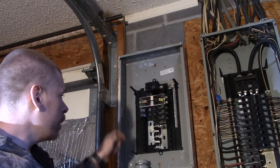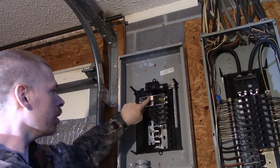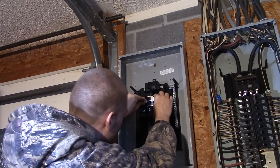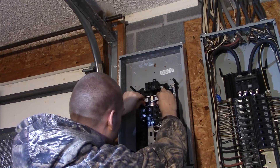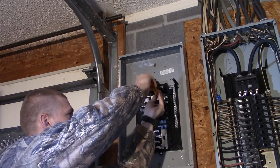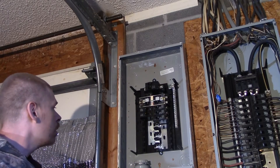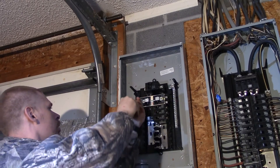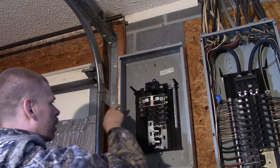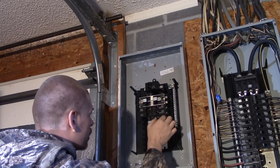It comes with two screws as well and a face plate to hold the breakers together closely. This plate goes on, and then you put these slide bars in, and then you put the main bar in. I'm going to close both the breakers, open the circuit, and then close it on one side. All I've got to do is put the screw in because it's going to hold itself — then the other screw. When power is coming in this side, it's supposed to turn off the breaker on that side and turn that one on.